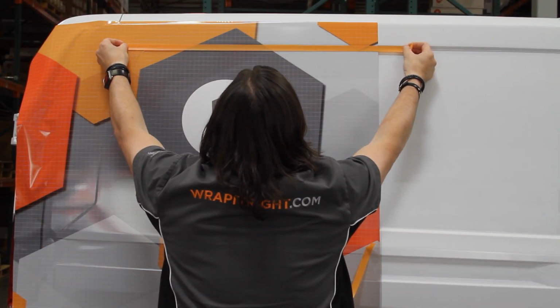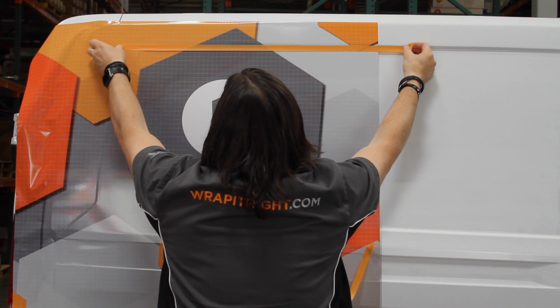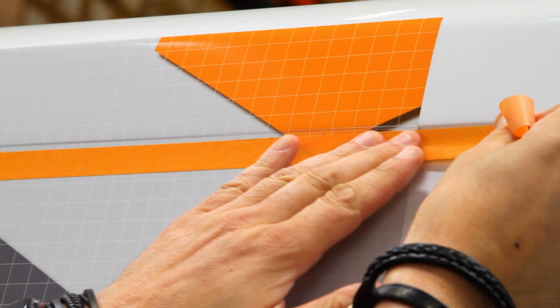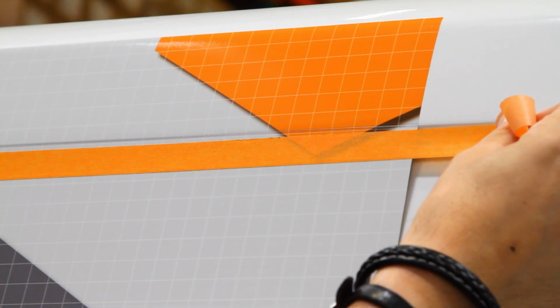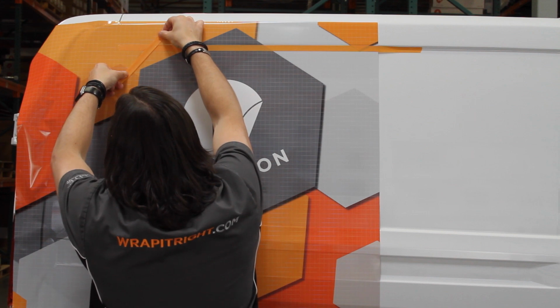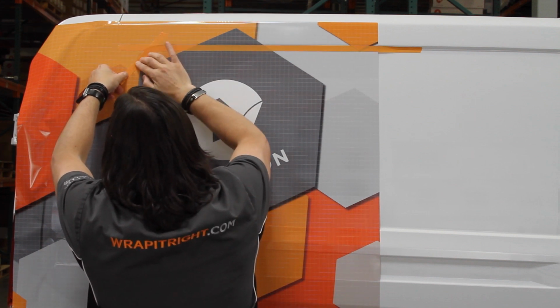This is where this technique starts to look different. Using the rolled edge as a guide, lay a piece of 3/4 inch masking tape 1/8 of an inch in from the outer edge. The tape should parallel the channel. The deeper the channel, of course, the wider the masking tape you will need.